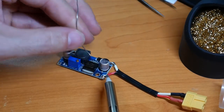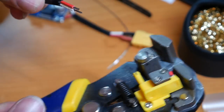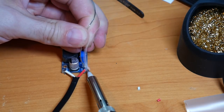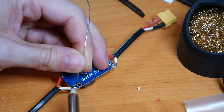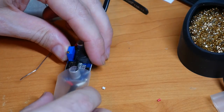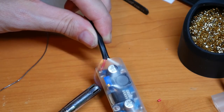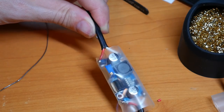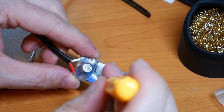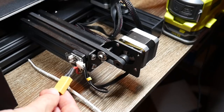Repeat for the second wire, soldering top and bottom and making sure there are no loose wires that could accidentally short. For the output of the buck converter, strip more of the same gauge wire and insert it in the same way to the output terminals, solder so there are no loose wires, and then insulate with a large piece of heat shrink. Slide it over the top, apply some mild heat with a lighter or hairdryer, and it will shrink around and protect against any shorting. Just make a small hole so you can access the adjustment for the output voltage, and your unit is almost done.